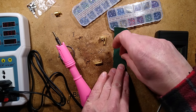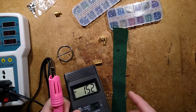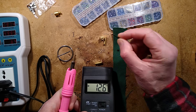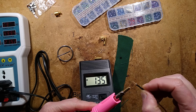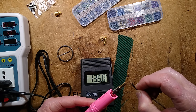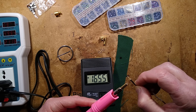I'm going to put some onto this piece of fabric here, which means I'm going to have to press directly down. Let's check the temperature so far — is it going to be 180, around 200-ish? Using the Sojourn tip temperature monitor, I shall simply place it onto that bit there, and it says 220 degrees Celsius. That's quite spicy — that's going to hurt if you get it onto yourself.